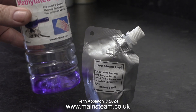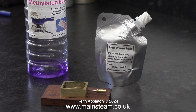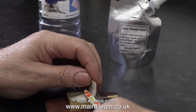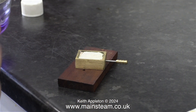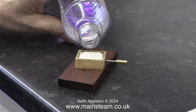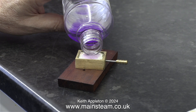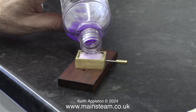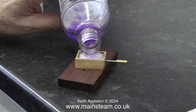Normally, these small steam toys quite successfully use methylated spirit in a suitable methylated spirit burner. But as I've mentioned, this is a very small traction engine, and I don't think there's enough surface area, even with meths. But I thought, well, I'll give it a try. What I'm doing here is cutting some layers of ceramic heat insulation to fit in the burner, and this will soak up the methylated spirit. On this particular bottle, it says methylated spirit — so to avoid confusion, I will also say methylated spirit, and not spirits.